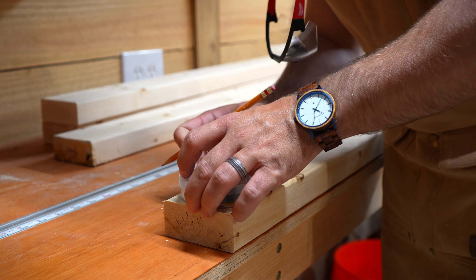While getting everything sanded down, let me explain the reason for the 10-inch on-center spacing. It all came from the Public Playground Safety Handbook, which gives guidance on entrapment — when a child gets their head between two parallel bars and can no longer pull it back out. The guidance recommends spacing be less than 3.5 inches or greater than 9 inches. The 3.5-inch spacing felt too close, so I went with 9-inch spacing; since the rungs are 1 inch in diameter, 10 inches on center gives exactly 9 inches of clear space. I'm a little worried this might be too far apart, so we'll see if a modification is needed.